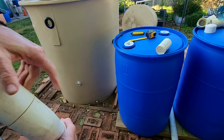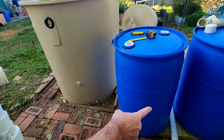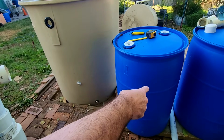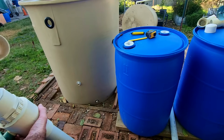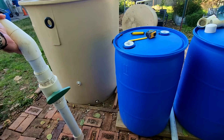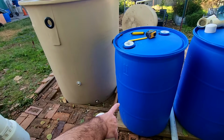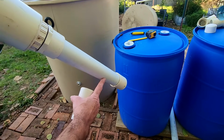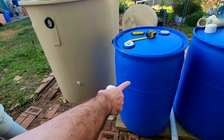I'll cut it off for the right height for the inlet into the radial flow settler. Now the base work underneath the radial flow settler and the moving bed bioreactor is nice and level, so I know where this is sitting. So what I want to do is just a dry run installation, so I can work out the level, how far down I need to cut this drain work for the double elbows that will be running into the settler.